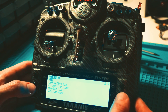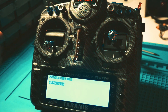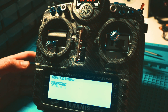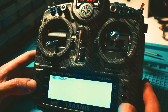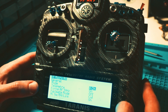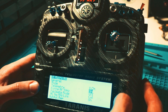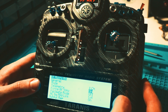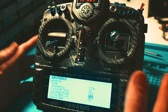Quick press Crossfire, then long press it. I'm going to plug in my drone and we should see the receiver pop up — there we go. I'm using a micro version 2 receiver, but it shouldn't matter which TBS receiver you're using. I have it on 8-channel mode, telemetry on, and failsafe mode set to cut, so if anything happens it's just going to stop spinning the motors.